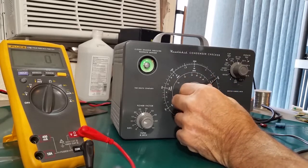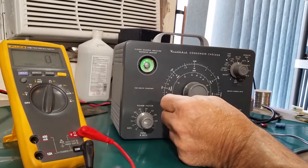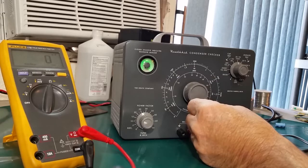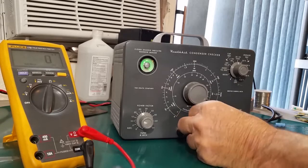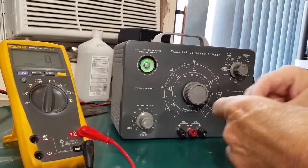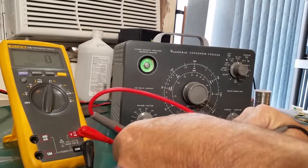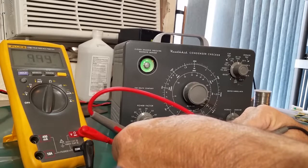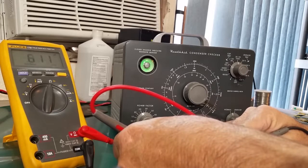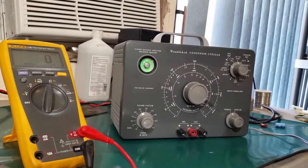There, it's got a wide range also, but it looks like it's widest right there, which is, yeah, the scale is really compressed there, but I'd call that 400 microfarad. So probably not as accurate on that really compressed scale, but again, kind of good for a quick check. The Fluke reads this as 500 and actually 611. So not as accurate on the high-end scale.